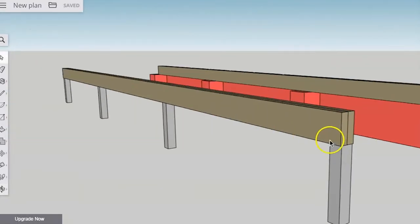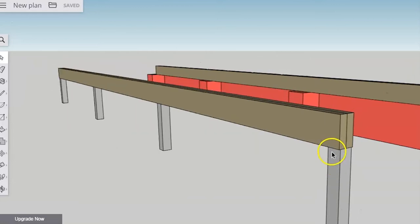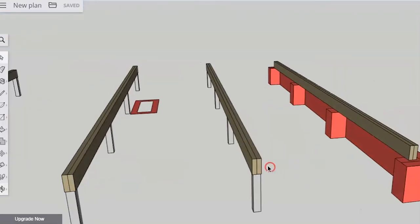You may have to pack up bearers so that they come level and straight with the rest. If you do, you need to pack with something that's not going to compress over time. Don't go sliding bits of cardboard in there — it needs to be something solid like a piece of steel or a bit of hardwood, something that's not going to compress over time with loads sitting on top of it.